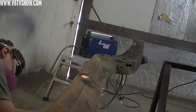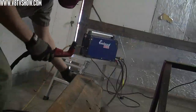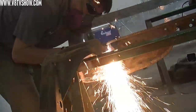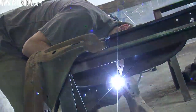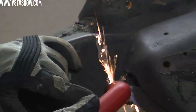Car frame material is up to about an eighth of an inch thick in some places where it's double-layered. It's a dual-voltage machine with adjustable amperage — on a 110 outlet you set it to a lower amperage, but when you plug into 220 you can use a higher amperage setting to cut thicker steel. On 110 it's still high enough to cut apart the frame.